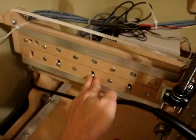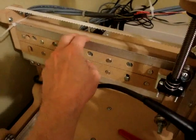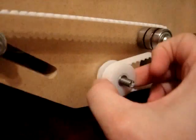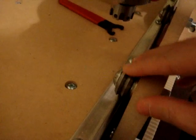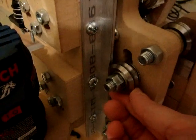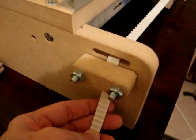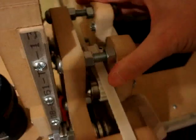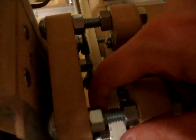Then you have the back support here, and you also have two pieces. One is actually adjustable on the bottom, and then you have the top piece for the Y-axis rail holders. On the side you can see the timing belts and a timing pulley. You have three bearings here — the V-groove bearings on the gantry side and on the Y and Z plate. These are the pieces that hold the timing belts in place. In the back of the Y-axis, you can see this is the motor mount. There's not much wiggle room here, and you also have the pulley and bearings in this location.